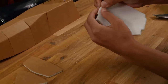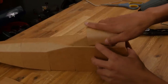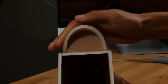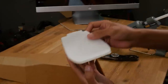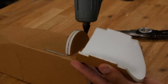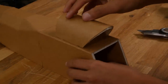Crush the tab a little bit on each side with your fingers to get it seating well in the tabs. Do one side at a time. Looking from the back, you should see the canopy is resting well on that former. Pull it off and apply glue to the four tabs on both sides and all across the top of the former. Do the same process — make sure the angled portion of the canopy is facing backwards. Now take the middle section, peel paper off one side, and roll it with your palm at the edge of the table a few times on each side. The foam on the inside will be nicely creased — any inside creases are fine because you won't see them, and the outside with paper still looks nice.